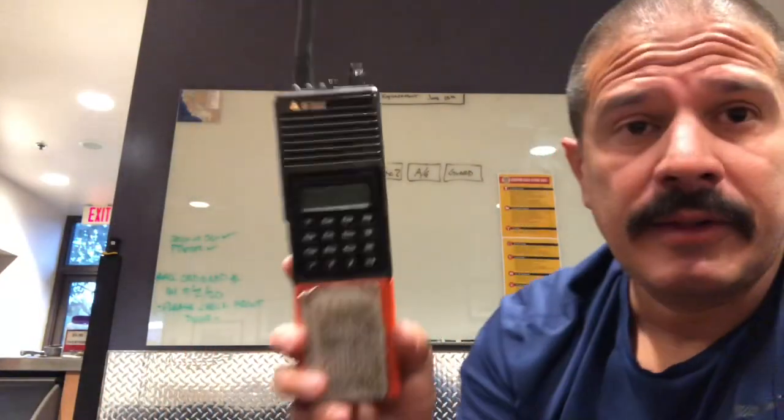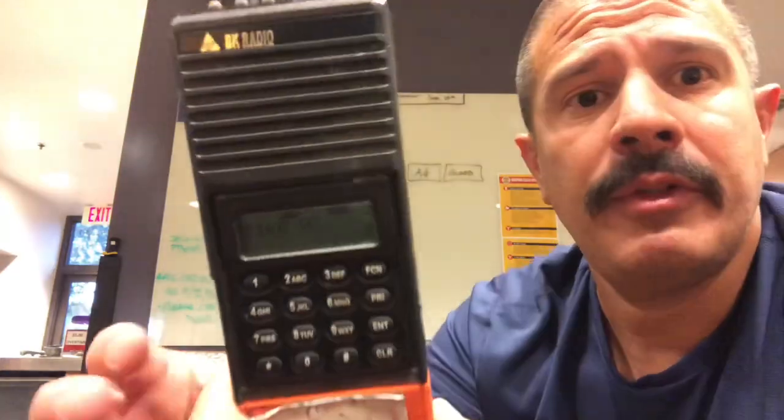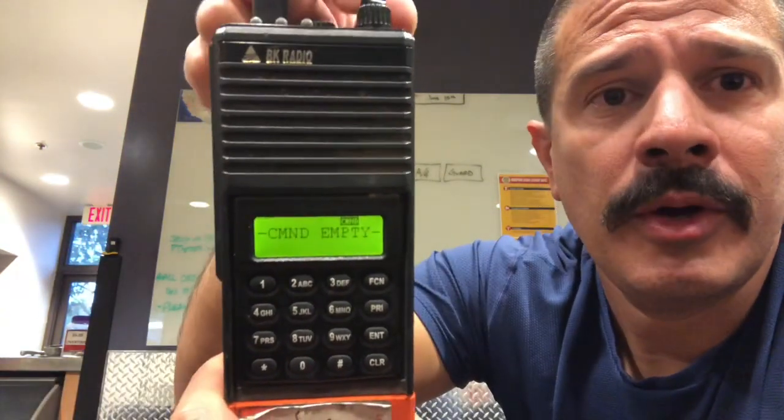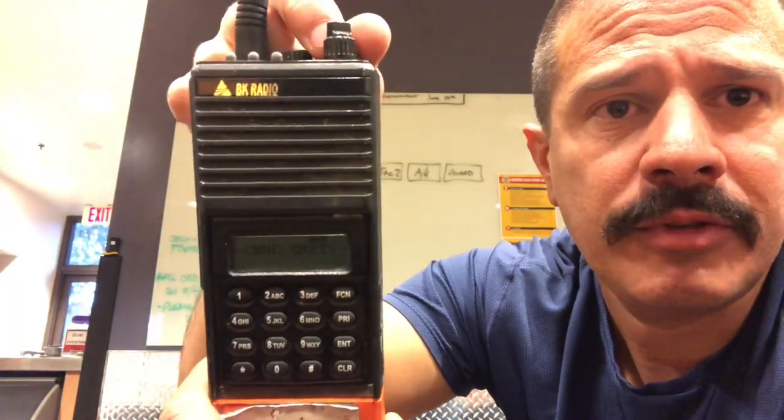The command group we're going to discuss and build momentarily is probably already programmed in your radio, but you need it for your fire — not the last fire. So if you press pound-pound-enter, you probably have some frequencies in your radio. If they're in there, just hold the star button down for a long time. It'll say 'delete all,' and then eventually it'll say 'command empty.'